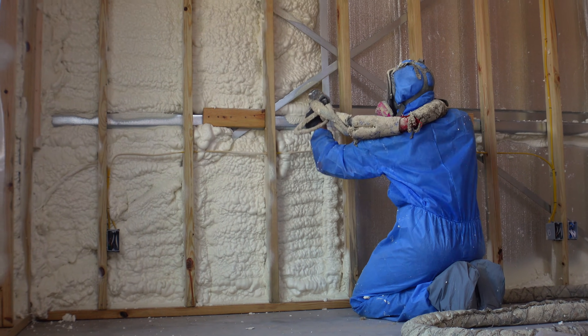When we did our spray foam here, we installed a vapor barrier first because we were going to use open cell. Claudio was telling me that open cell is more suited for the South — since we live in Florida, open cell is more suitable, but it's not a vapor barrier itself. So what we did is run a vapor barrier and then apply the spray foam on top of it.